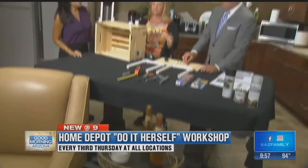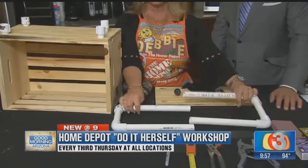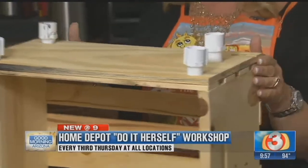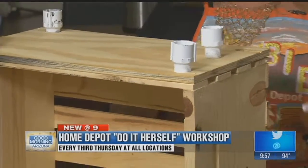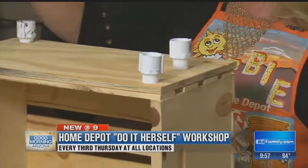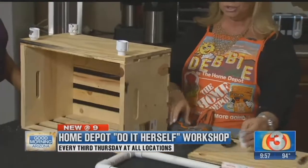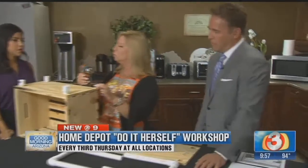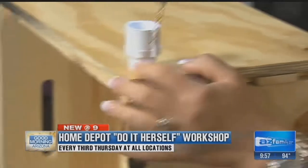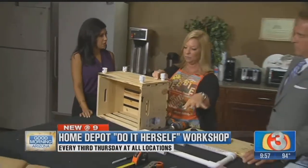In the first segment, we talked about how to make the base. We cut our PVC pipe and put our elbows together to make our legs, and then you're going to take a two-by-two piece of three-quarter inch plywood — or you might have some at home — and cut it to size to fit the bottom of the crate, and that's going to give it support. Then you're going to take an inch hole saw that attaches to your drill and cut four holes to hold our adapters that will actually hold our legs. After you drill your four holes, before you put your adapters in, you want to pre-drill a couple holes because the wood will split if you just put the screws in there. Pre-drill holes in all four corners before you put your adapters in, then screw your adapters in and put your legs on.